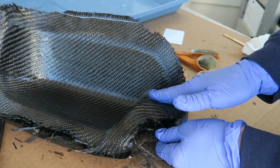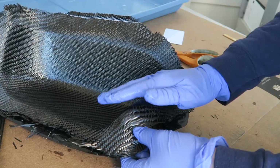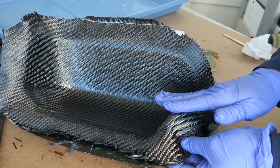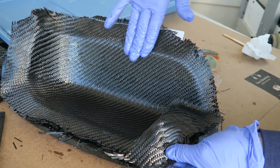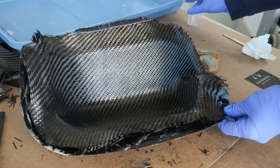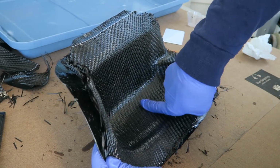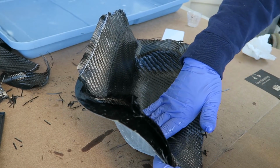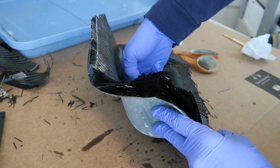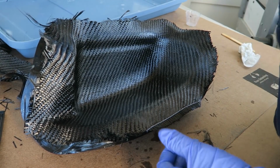It's an even more equipment-intensive process with a lot of disposable parts to it, so I'm just seeing what sort of results I can get doing it hand laid up and then into the vacuum bag process, as opposed to doing a resin infusion, which is going to give you the best pinhole-free results, or something like a pre-preg, but I don't have an autoclave set up, so I haven't experimented with that at this time.